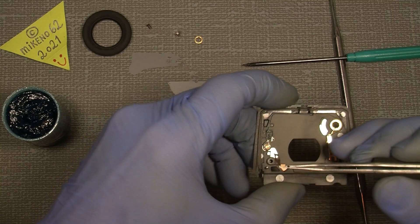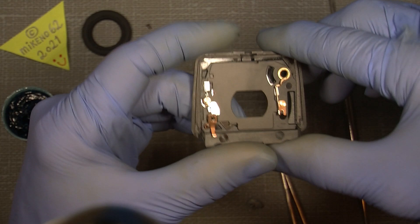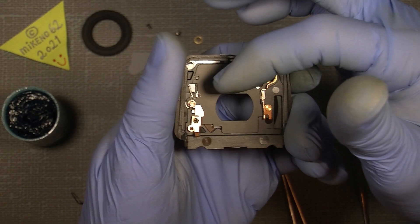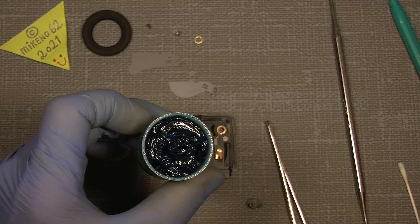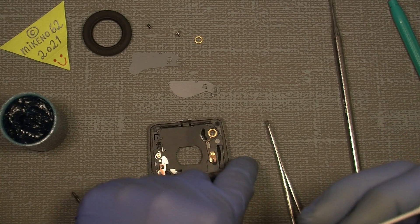Put this part into place so it will sit there. Get the screw in and then we're back to almost normal. Don't put the spring on yet because we need to put in the blades first. Before doing so, I'll put a very small amount of grease on the eyepiece shutter lever pin - that's the only pin that needs something.